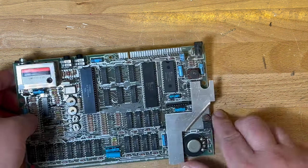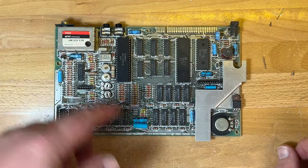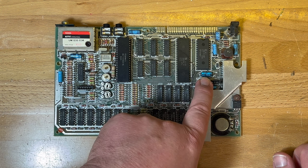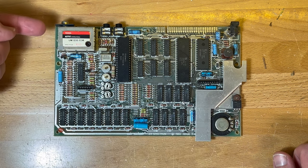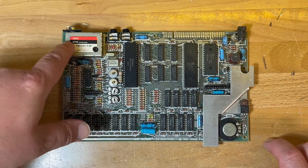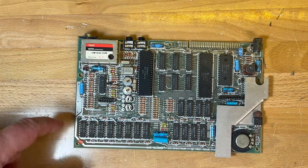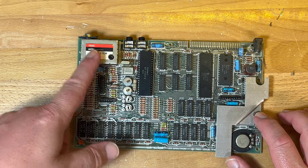I was having a look at Mr. Tynemouth's blog — he's done an interesting write-up on fixing an issue 2. He replaced the regulator, replaced the 1 microfarad 50V capacitors, and did the composite mod. He said he did the 100 microfarad electrolytic and the output wasn't very good, so he did the common emitter buffer mod — the kind you do on the ZX81. I actually should have some boards I can use directly. I'll do that first just to see if we get some sort of image out of it.